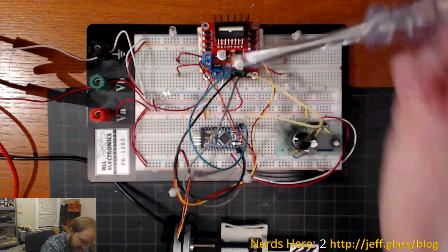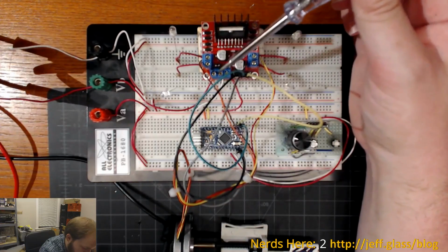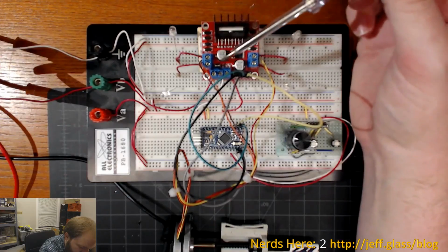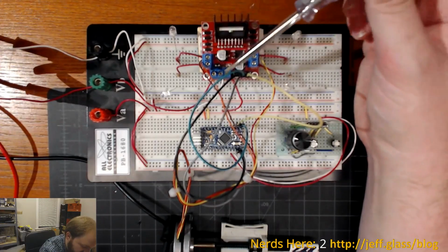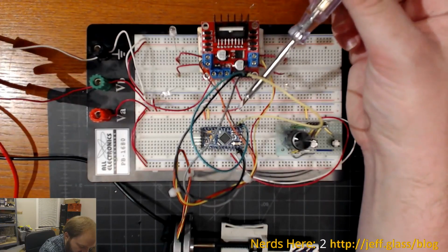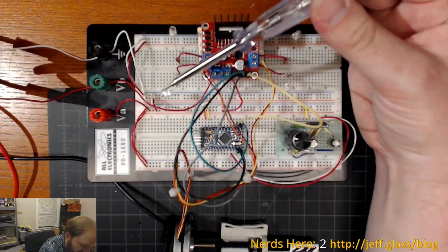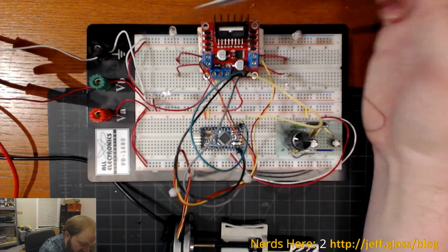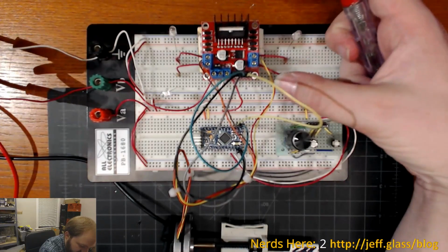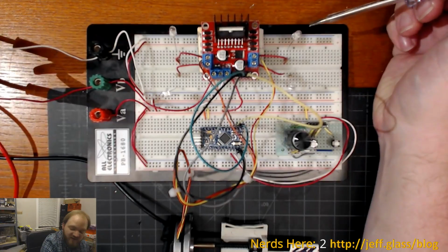It has a power input for the driving voltage of the stepper motors in question. We'll look at how this is all wired up in a sec here. It's grounded, and it also has a 5-volt regulator on board, which I'm using to directly power this Arduino, which is quite nice. Then you'll see it has 4 outputs here, hooked in parallel with these little LEDs, which I just wired up in place so it would be a little bit easier to see when a given output is on.